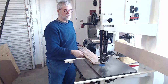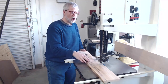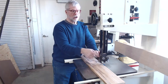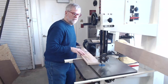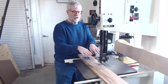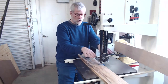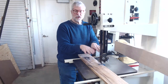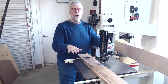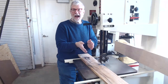The third safety point is the three-inch rule: as you're passing a board through the saw, keep your fingers at least three inches away from the blade — and not only where the blade is, but the path of the blade. If you hit a hard spot the blade will slow down, and when it hits a soft spot the wood can suddenly push forward. You need to keep your fingers away from the blade on either side so that as you push the wood through, your fingers are completely out of the blade's path.